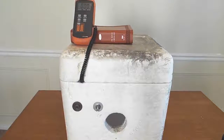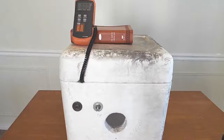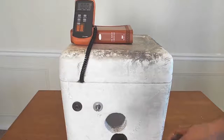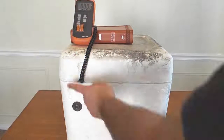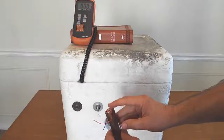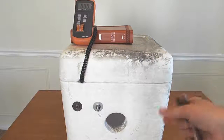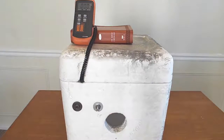One other thing I want to mention is when I did the individual bare LED tests, you will need to calibrate differently for that, just because this is not the best integration you're ever going to get. This is not a professional device. When we're shooting a flashlight in there, all of our light is bouncing off the back wall and a little off the sides and then coming back to the center, or to the sensor, and that actually works pretty well if all you're going to measure is flashlights. But because all of this light is already spread out, you'll have a different calibration number, so you would need to have a known source for this and come up with a new multiplier, which is what I did when I tested the 100-watt emitter, in internet lumens versus actual lumens.